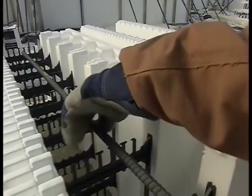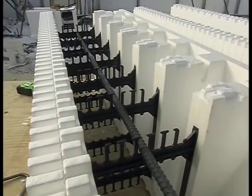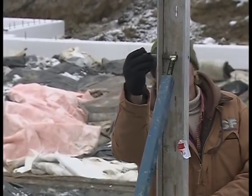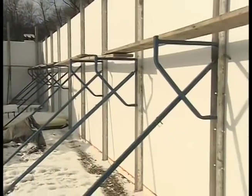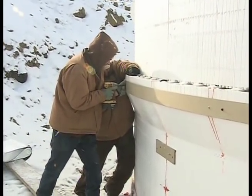It's got to be in just the right spot for the engineering — and it snaps into place, which also prevents us from having to tie any rebar. The vertical rebar slides between the horizontal and stays where it's supposed to. You also see a lot of bracing around here — you've got to keep everything plumb, right? It's kind of clever how you're able to work the scaffolding right into the bracing — kind of kill two birds with one stone. And it's adjustable to height as the wall gets taller.